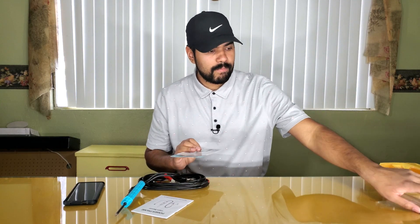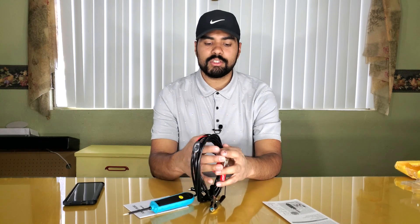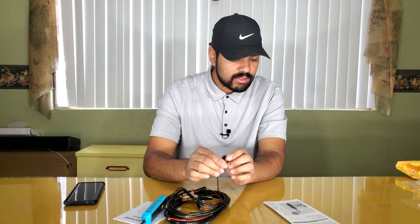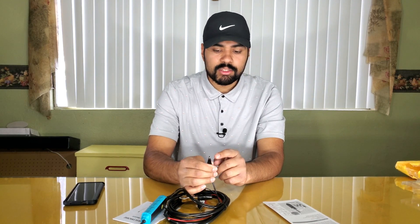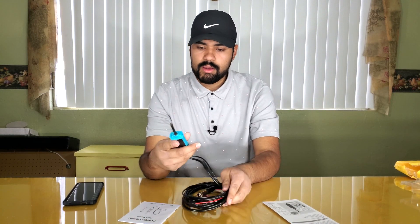The manual says 'Electric Circuit Tester.' Applications include: test for continuity, test for polarity of voltage, check amps, check electric motors, power supply functions, follow and locate short circuits, and test for bad ground contact. So clearly you're going to hook this up to a 12-volt battery — you need a constant 12 volts and a ground.